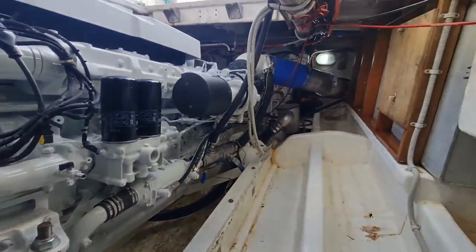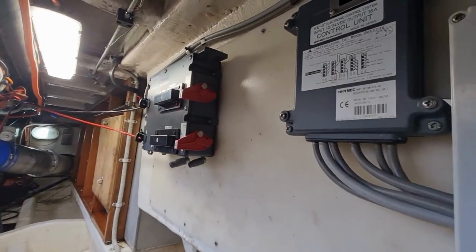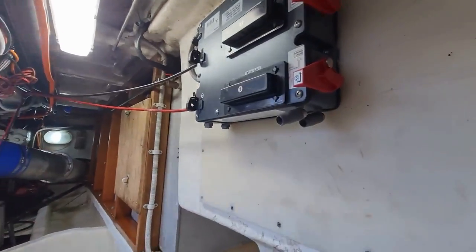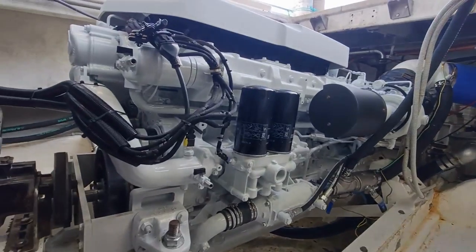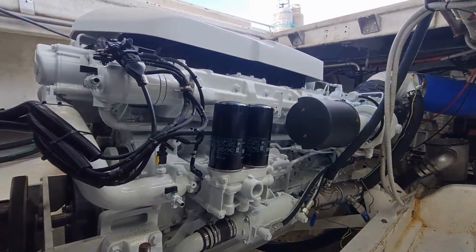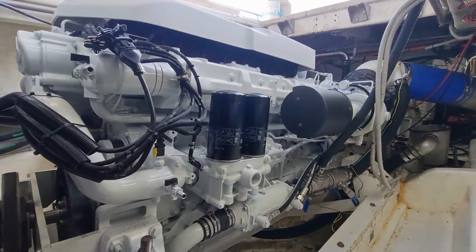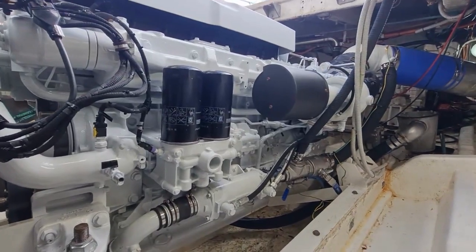As we come around you can see just how much room we have in this particular vessel. This vessel is running a Twin Disc electronic throttle system which still uses manual cables for both gearbox and engine. The Cursor 16, being a common rail fuel injected engine, can accept an electronic throttle input via CAN bus or voltage 0.5 to 4.5V, but in this instance we're still running cables.